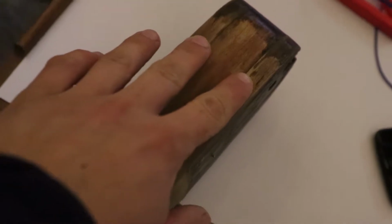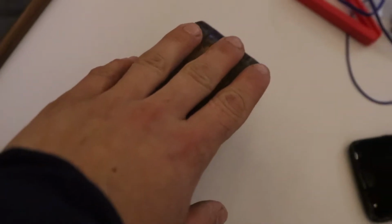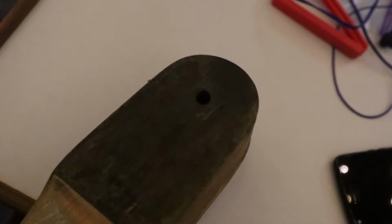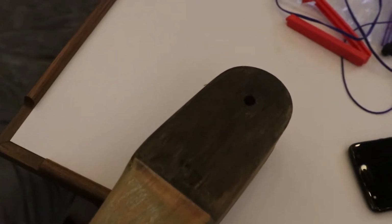so we will be doing a repair on the tiller, removing these two sections down to about here on this side and down to here on this side, and replacing them with new teak, and then reassembling this. It's all totally molded on both sides. And then we'll revarnish the tiller and we'll be ready to go for a little while.